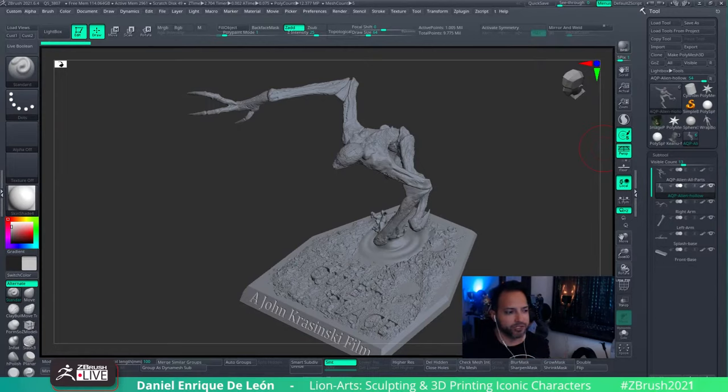No matter what kind of 3D printer you have, there are always going to have to be supports for any overhangs that go past 85 or 89 degrees. Once you're going to 90, it can't print straight out into nothing. You need to have something to meet it, unless it's oriented like a tree. So in this case, I could do that for a fair bit of this, because the base could be printed pretty much inverted like this, because the splash grows out literally like a tree. In that kind of growth, it's self-supporting because its layers are centered below it before they expand outward at all.